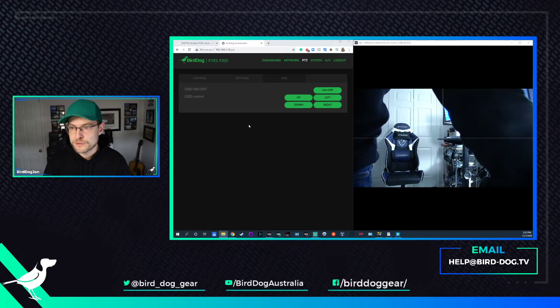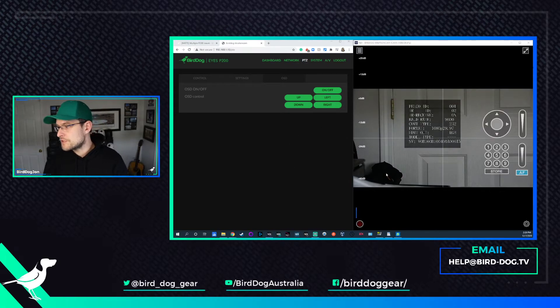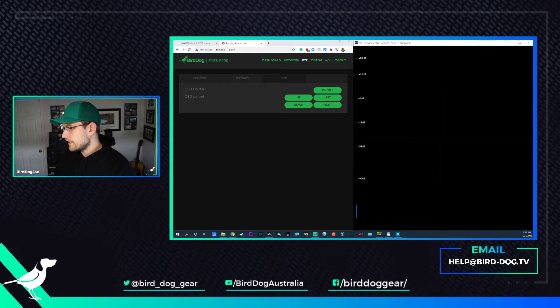So it's doing its little boot-up dance right now. When we see it in Studio Monitor, we should be able to refresh this web page and get back to that actual site. While we're waiting, I'm going to extract my firmware and dump it on the desktop. Once that camera comes back online, we can take the USB stick out — we don't want it updating every time it boots. I'll let that finish booting up and then remove the USB stick. I've got my firmware on my desktop. I can see the camera, and there is the new firmware version that's on the stick.